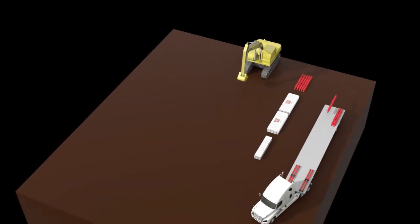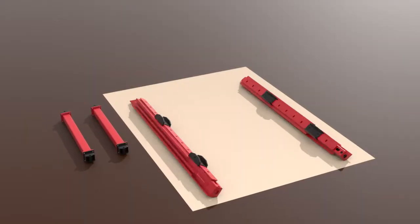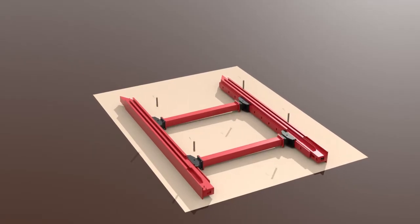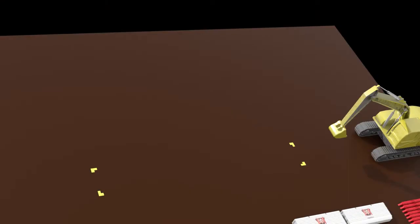Organize the job site and stack the equipment neatly for fast and easy access. Next, start assembling the 18-foot rails and braces to form complete rail pairs. Continue to mark out your pilot excavation based on the outside dimensions of the shoring provided.